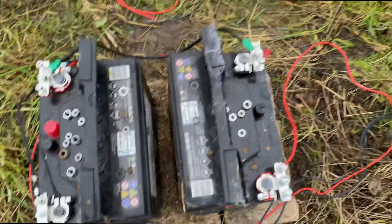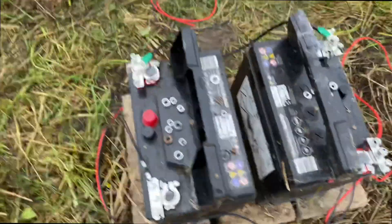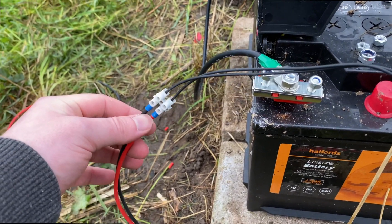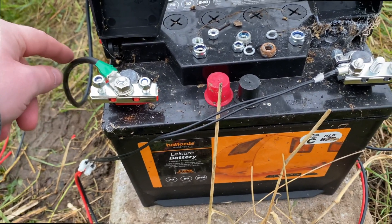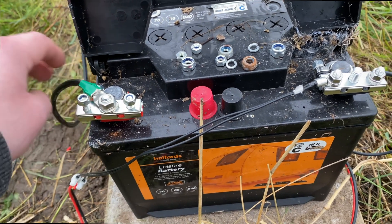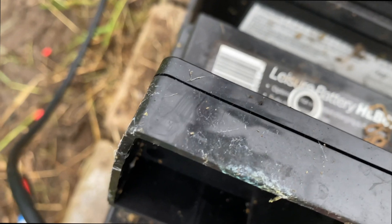We've replaced all the leads up to the solar point and everything's plugged in correctly. It doesn't make much difference visually, but the connectors go into the NTC — they're supposed to be both negative, but I ran out of negative wire so I used positive wire, red and black. That should now be charging. We've got the eight gauge wire between the two batteries, and all the bolts are nice and tight. Everything is working, which is really good.